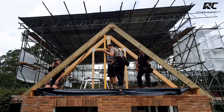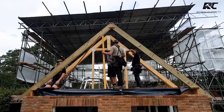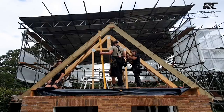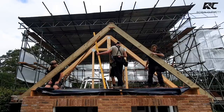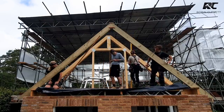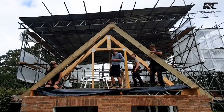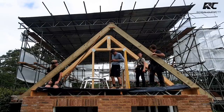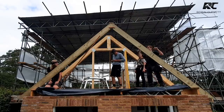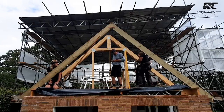We haven't got to worry too much in a minute. We just need to make sure when we get the ridge in and all the rafters in, then we'll put a proper brace on and straighten the first one up. Because bear in mind, I'm going to put these plates on here from my fix through there. It's going to straighten them up, like a T. I'll be fixing all the way through there with the head plate of the stud wall, hard against my head plate. So this can be flippy floppy, but when we put a nice bit of 8x2 through, it will be pukka.